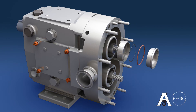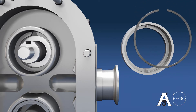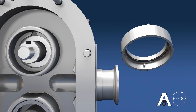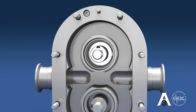The inner seal assembly can easily be removed by your fingers or a small pick. The seal assembly consists of stationary seal, O-ring, wave spring, and sleeve. When replacing a seal, it is best to remove the seal sleeve from the bore for proper wave spring installation. The best practice is to insert the wave spring on the bottom of the sleeve behind the stop pin. Then the cutaway portion of the spring fits into the opposite pin. Turn the spring clockwise until it is secure and behind the pins. This will also prevent the wave spring from falling out during seal installation. Reinstall the sleeve back into the shaft bore by aligning the pin on the backside of the sleeve to the slot cutaway in the shaft bore of the body.